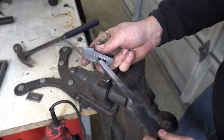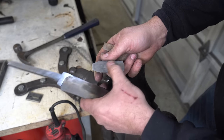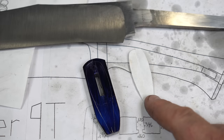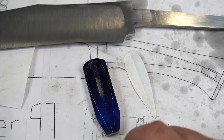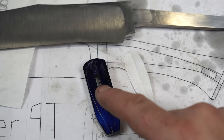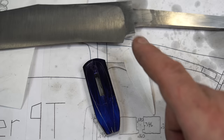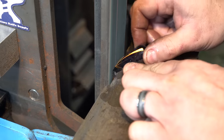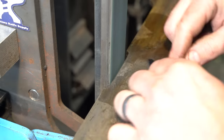I think we've got our guard fit. I'm going to clean it up on 120 grit to take all the little bumps out. Now we should have a guard that fits really nicely. I created a template for the guard, drew it out on the steel, and now we're going to grind to it. I want to get close because we're going to be putting lineup pins in and I want to make sure the pins aren't going to fall off the edge. I'd also like to take a moment to mention our sponsor, Maritime Knife Supply — they have everything you need to get your knife making up to the next level; go check them out, you can even shop in US dollars.